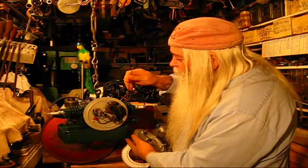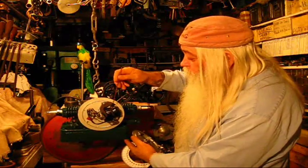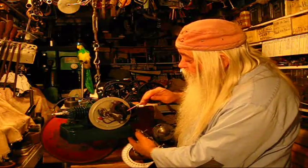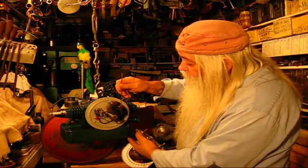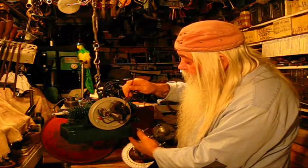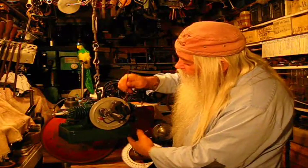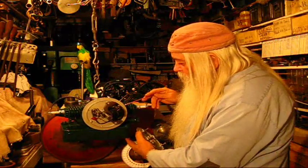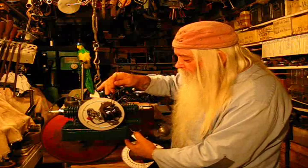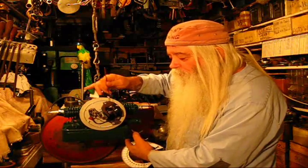That means that one side of this coil is weaker than the other side. These are individually wound coils connected in the middle — it's two coils joined together. If you took this apart and checked the coil, it would probably show different resistance — weaker or stronger. It's possible to cut these coils apart if you've got a bunch of them; you can take them apart, check the resistance on each coil, and find another one with like resistance. The closer the resistance, the better they work.